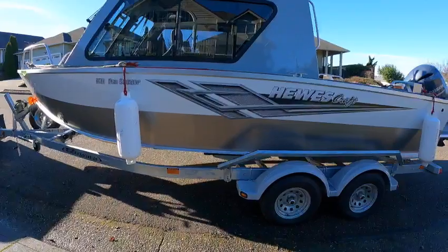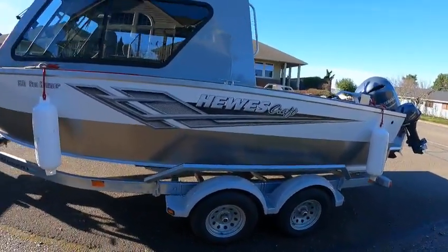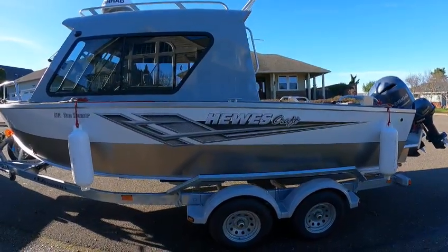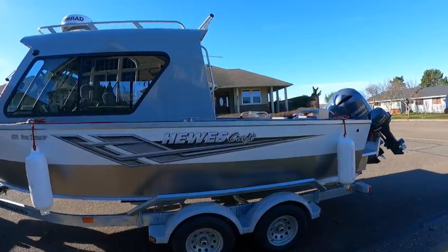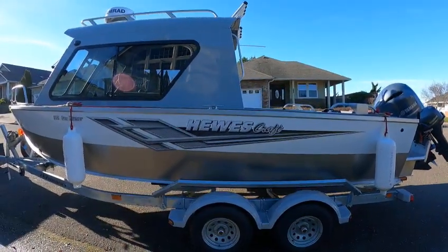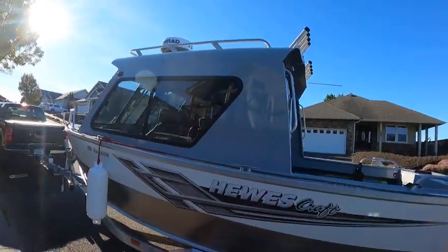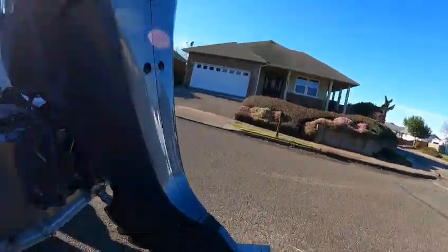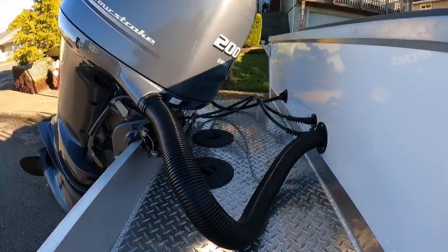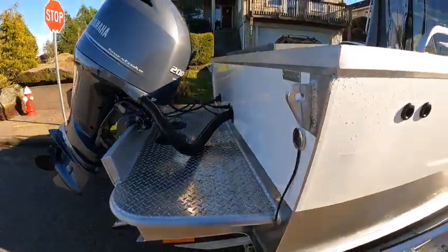Inside depth is like 29 inches. This is like a 15 by 22 by 35. That's a semi-variable degree hull. You've got 190 on the bottom gauge; bottom width is 78. Side gauge is 125, which is really good. Height sides on the outside are 32 inches. 8 people, 1,320 pounds. 2,870 max weight. Boat weight is 2,800 — which is pretty light. You've got a lot of room. This is a 21-foot boat; look at that deck room. You still got a nice cabin, can fit six people in there, and you still got fishing room back here. Your fuel fill is back here. Up underneath that lid there's a seacock valve for your washdown.